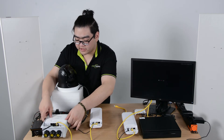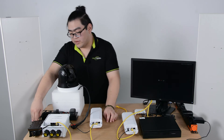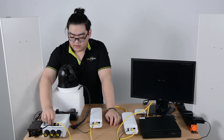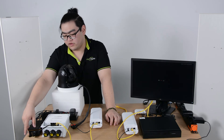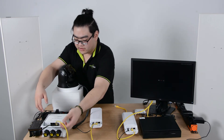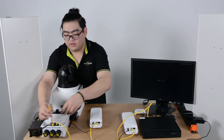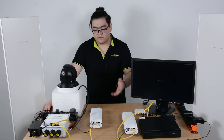You can see there are indicators on it as well. This PoE powered switch has 100 megabits per second per-port bandwidth, and the total bandwidth can go up to 1000 megabits per second. It also has a very wide working temperature range, so it is safe in all sorts of outdoor conditions. Once we have connected our PoE powered switch to our wireless network bridge, we connect our PTZ zoom camera to any port and we should be good to go.